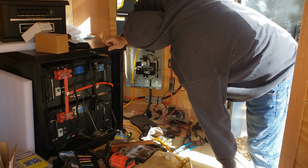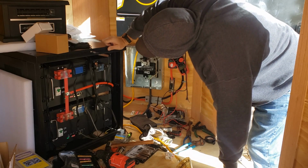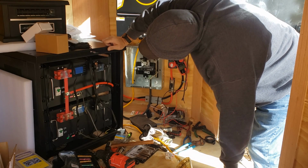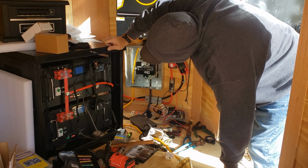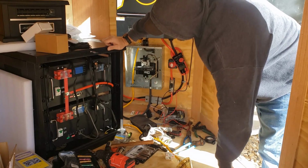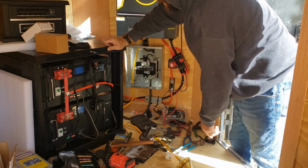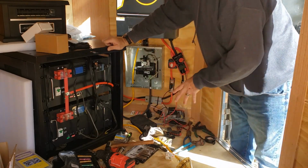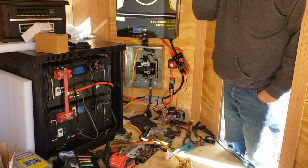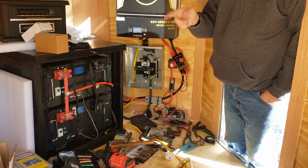Alright, so this is our first test. Test a couple components. One, that 150 amp fuse doesn't pop. We're going to check the AC inrush out and DC inrush in. It's a single phase 6500 watt EG inverter going through the SolarEdge, single to two phase 220 adapter, and going into this well.